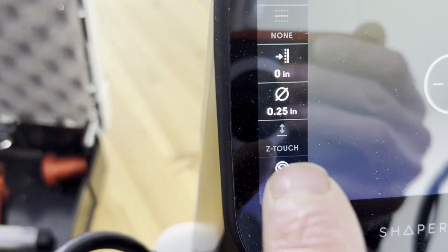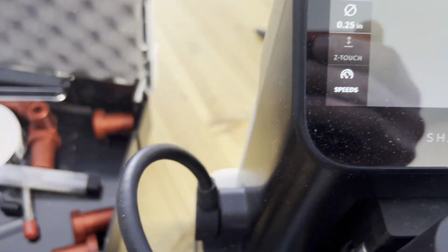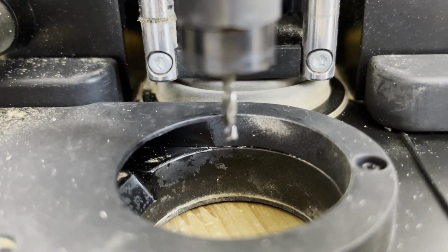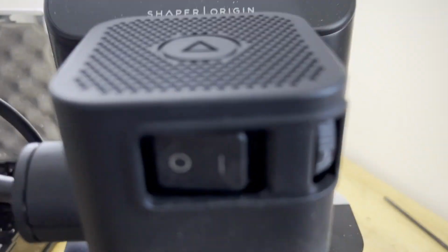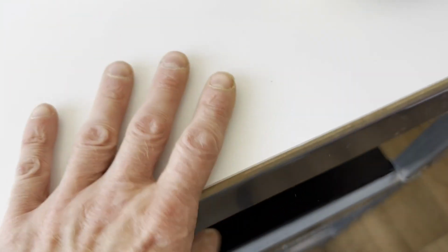And I'm going to change the bit manually to 1/8. To cut plexiglass, you need a 1/8 bit. Okay, and the speed, you lower the speed, because with plexiglass, if you turn your bit too high, it's going to melt. The CNC can go higher, but anyway, I put it at 2. At 2, that's enough. It's very easy. And you cut with the paper sheet.